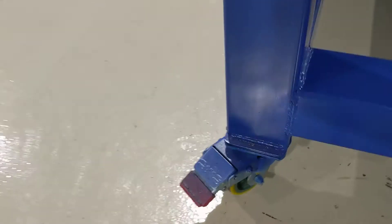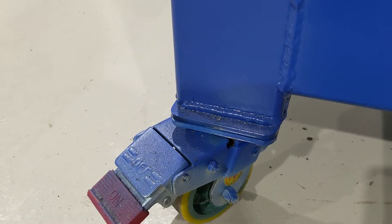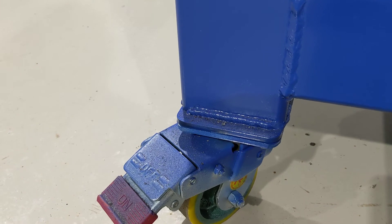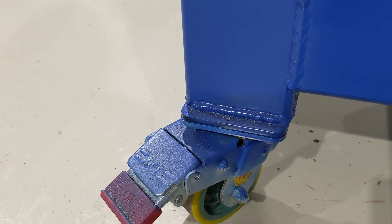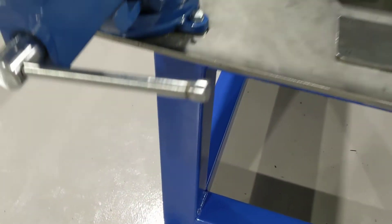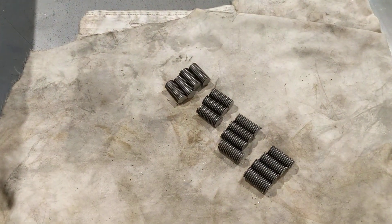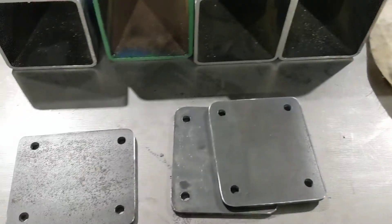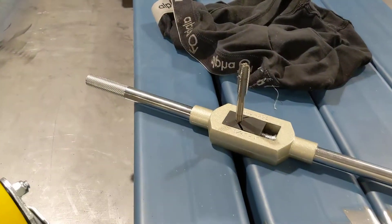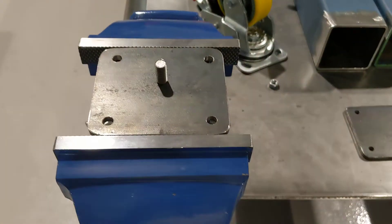The reason we need to do that — if I duck down here — you'll see I want to mount the casters on the end of the leg, and I don't have any way to get a nut and bolt inside the tube there very easily. So where this gets a bit tricky, we're going to make some studs. I cut up some threaded rod and made some little studs. I drilled all these plates out with an 8.5mm drill bit, which just so happens to be the right size for my friend the M10 tap. Come over here to the vise.